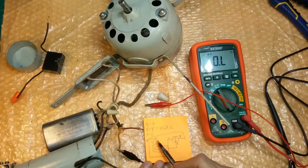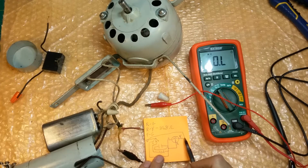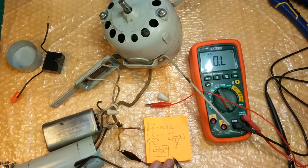When you go to 1, the AC line goes through this resistor, which drops the voltage. So if you had, say, 120 volts, when you come through 1, you're probably dropping 15, 20 volts here, and the rest of the voltage, so 120 here, you got 100 across it, because 20 volts is dropped there. Okay, let's just give you an idea. That's not the right numbers.